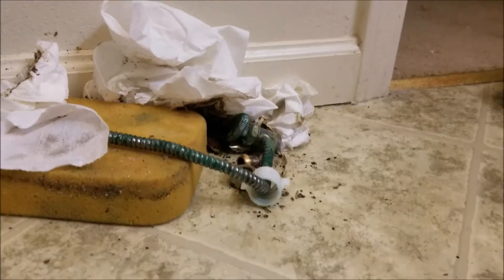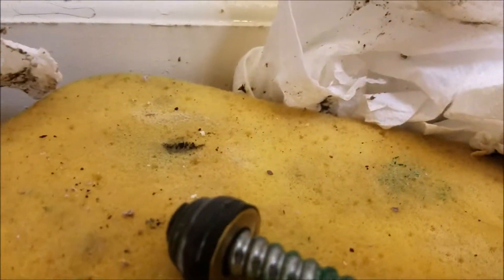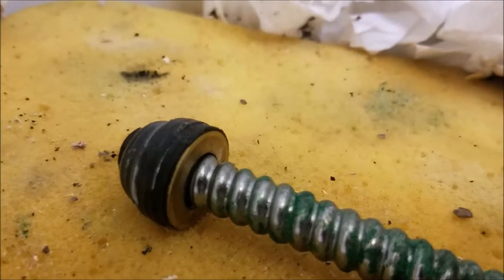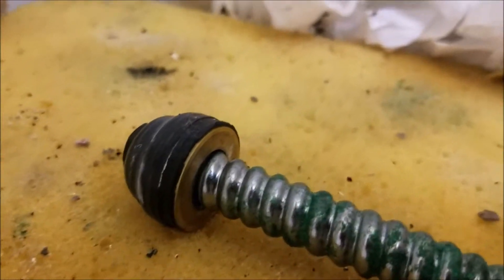So we're in Fresno, California getting ready to set a toilet. First thing we did back here is we had an old integrated shutoff valve and supply line. These guys are notorious for leaking. You can see the gasket in there — you get replacement gaskets and you try to put Teflon tape on there, but ultimately what happens is you end up with a leak down there and you get a service call. It's a needless expense.